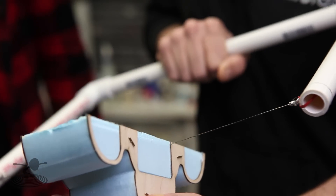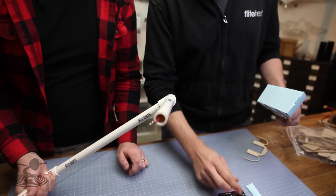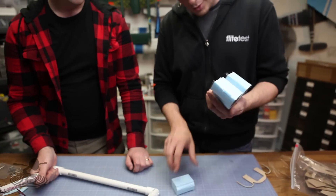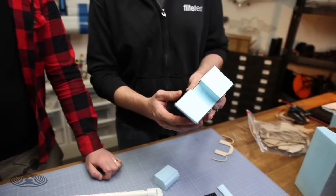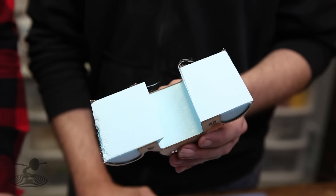You should have seen some of my previous wings I tried to cut — try being the key word, I never got a successful one cut. Turn it to zero. Oh wow, look at that — that's awesome! The thing most people do wrong the first time is use way too much power. You want to go as slow as you possibly can and still make the cut. That really nice, slow cutting gives you amazingly clean lines.